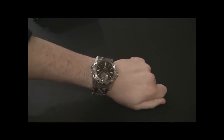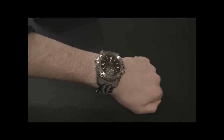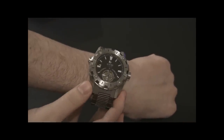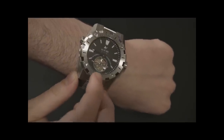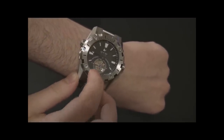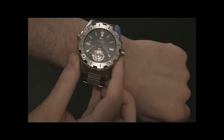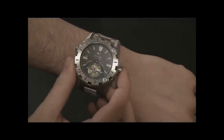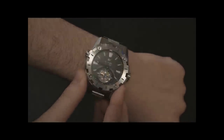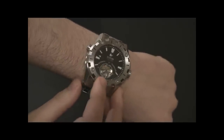Back to the tourbillon — you might ask yourself how the Chinese can make something so complicated that takes so much effort in marketing, design, and research in high-end European watches. This is a basic tourbillon. The escapement is actually moving around on a little carriage — while it's oscillating, it's also rotating, moving around once every 60 seconds. If you look closely, there's a small hand, so this doubles as a subsidiary seconds hand. The idea is to make the movement more accurate by canceling out the effect of gravity on the balance wheel.